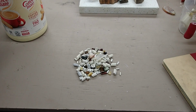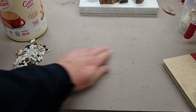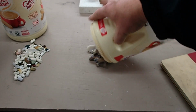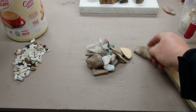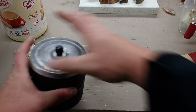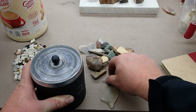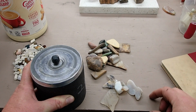That is actually a very good question. There is a lot of information out there about people using spacers as fillers. There's also another option for fillers. So let's slide these aside. We've already looked at these enough. If you're looking for filler for volume, let's just do this here. These are rocks I've previously tumbled. They've gone through 60-90. What I'll do with these is add them in with these barrels to fill the volume back up to the level I want. So like this one here, I'll use that one, that one, that one, and those right down here at the bottom.